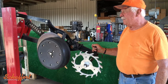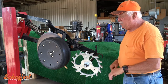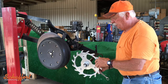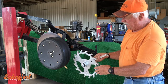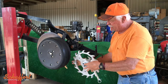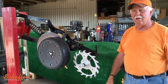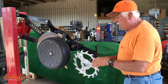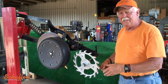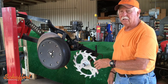Today we're looking at the Case IH 500 drill. Originally, with the regular press wheel that Case IH has on those drills, that wheel was pitched out so far that you would have had to almost back the planter through the field in order to get it to close the trench. Guys were complaining that they didn't get good closure on their no-till ground.